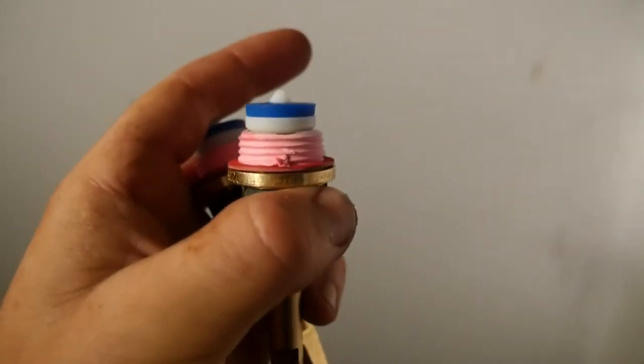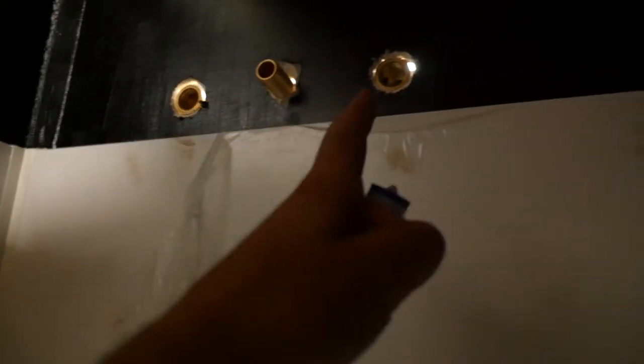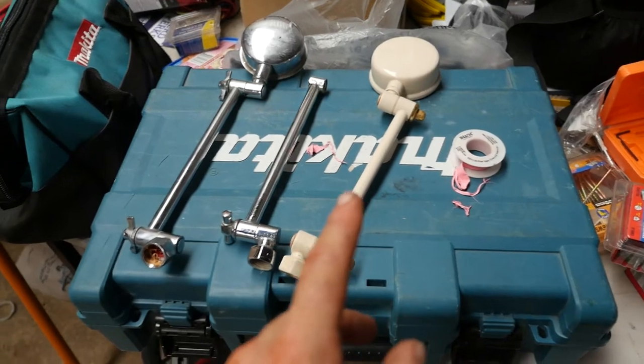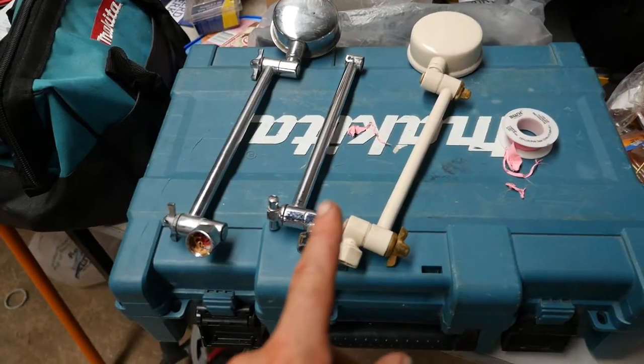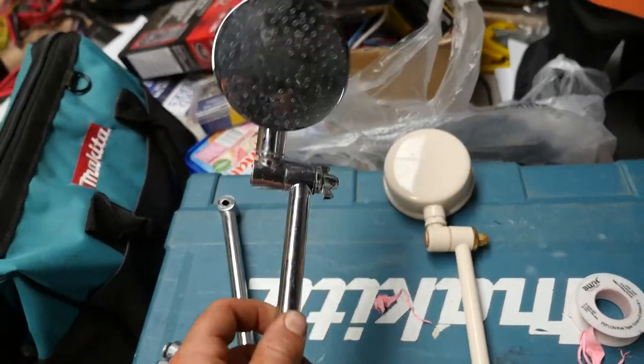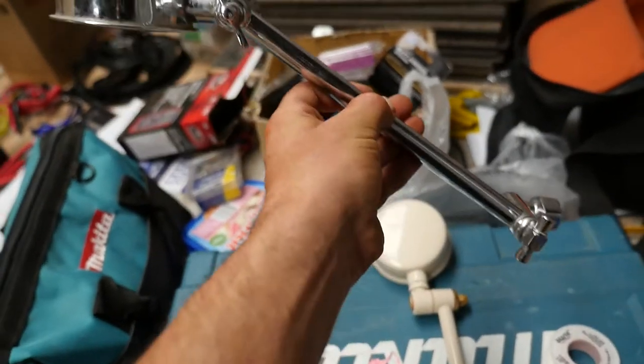I've got to install these tap valves. I've put a bit of thread tape on, just like I showed before — one will go on the left, one will go on the right, so hot, cold, and this is where your shower head comes out. I'm just going to put them in for now to test the water flow, make sure there's water, and make sure water goes out the drain. Tighten it up with the spanner. Now I just need to get the shower rose connected — I've got a spare one laying around, so I'll put thread tape on this and connect the shower rose. I've got three here that were left over from a job. I think this middle one should be all good — I've replaced a couple of parts and made it work. I'll connect it up in the shower and see how it goes.